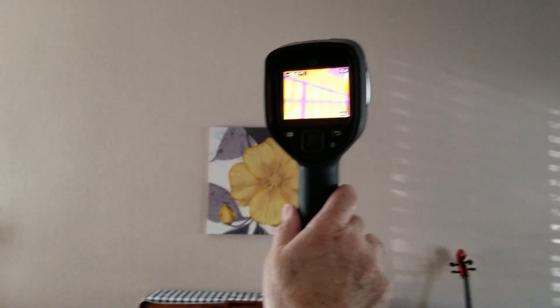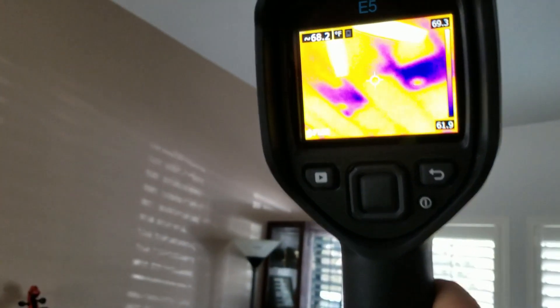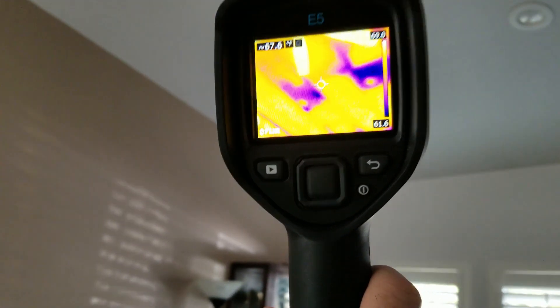When they're not touching, you get these voids in the insulation which contribute to rooms being uncomfortable, hard to heat and cool, and it just wastes energy. We can take this camera quickly and show customers around the house where there are problems in their ceilings, and later on we go back and show how we fixed these problems with the FLIR camera again after we've insulated the attic.